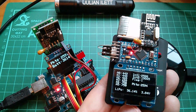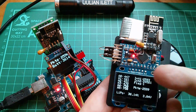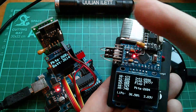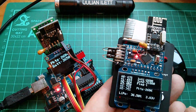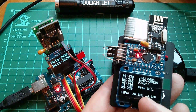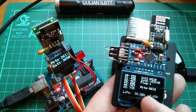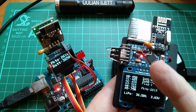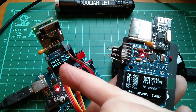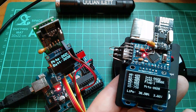There is a mechanism — it's not enabled by default — but you can switch it on to enable the receiver to put actual data in its acknowledgement packet, the packet that goes from the receiver back to the transmitter. That's what I've done here: I'm putting in the packet count as an integer and the battery percentage level also as an integer, because I haven't worked out how to do it as a float yet. So I had to put an OLED on the transmitter in order to display that data and confirm it was coming over properly.